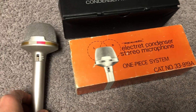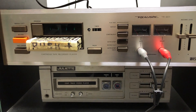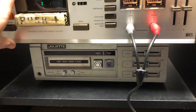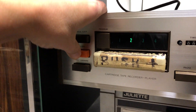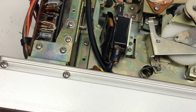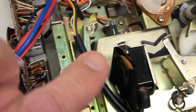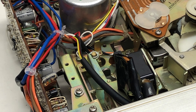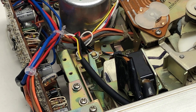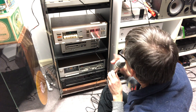Check out this astonishingly cool Realistic microphone — it's a condenser microphone with double jacks left and right. Got a homemade 8-track in there and we'll see what happens. I'm on track 2. I'm going to press record. It won't even budge — I'm pressing pretty hard. I think I figured it out: you actually have to put the tape in while holding the record button. Now the record button will move. There's a hook — if I put the tape in while holding record, you can see the lever comes up, and when I press the tape in it actually stays there.